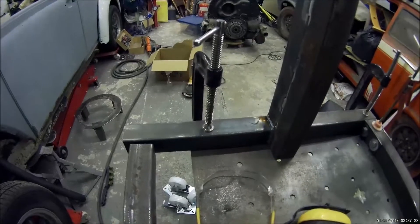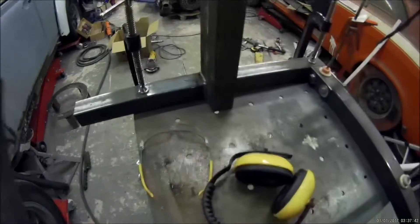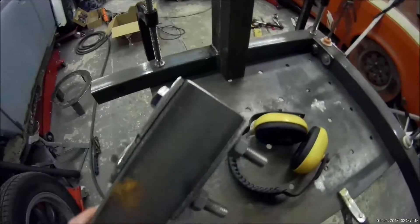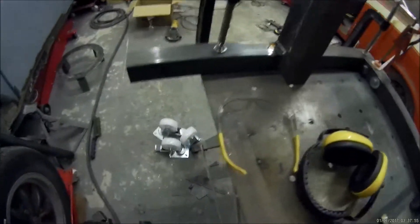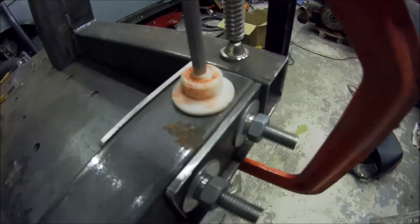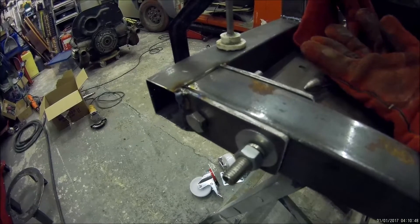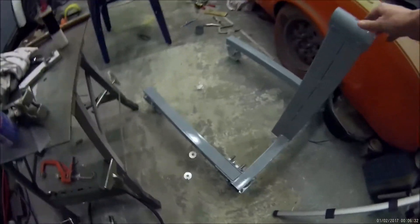The simplest way to mount these legs would just be to weld them straight on there, but the only trouble is that makes it a bit bulky and difficult to store, so I want the legs to be removable — that's what those plates are for. You can now see them bolted through the box section. These plates are going to be welded onto this piece; the legs will then unbolt. I'm going to tack those into place, remove the bolts, and fully weld. The legs just bolt in there like that — it means they can be removed and stored. The fixed casters are at the front, swivel ones at the rear. I'm not really sure which way they're supposed to go.